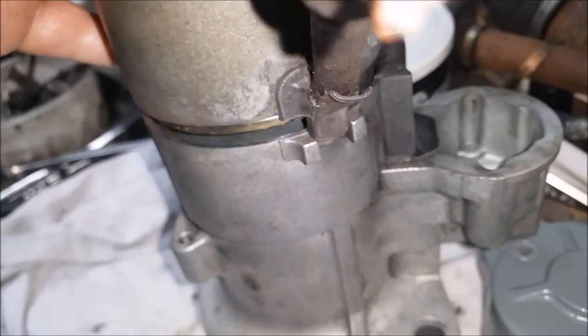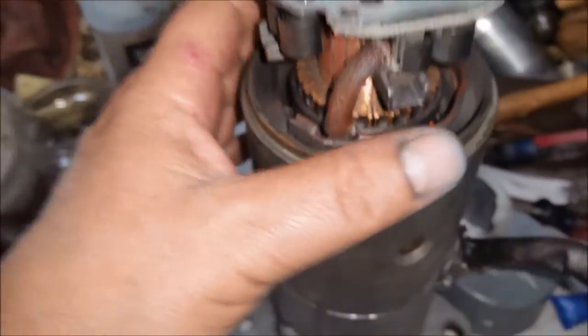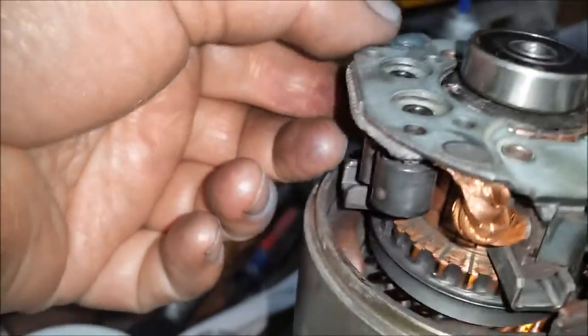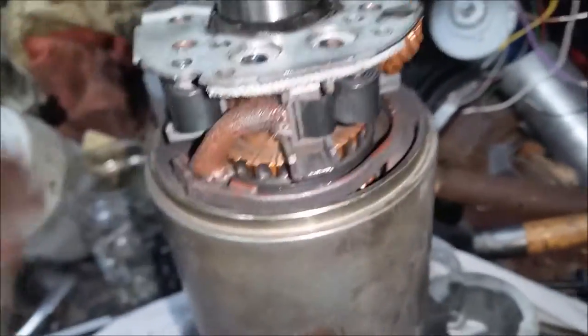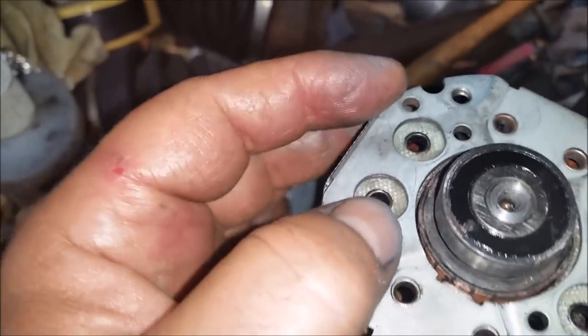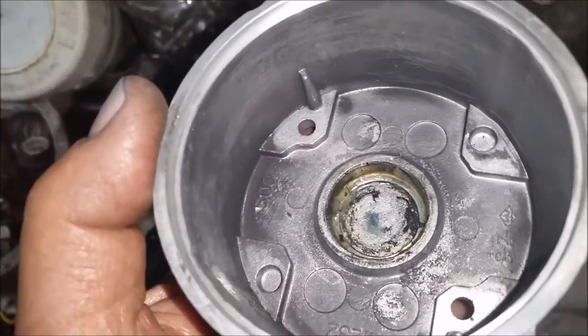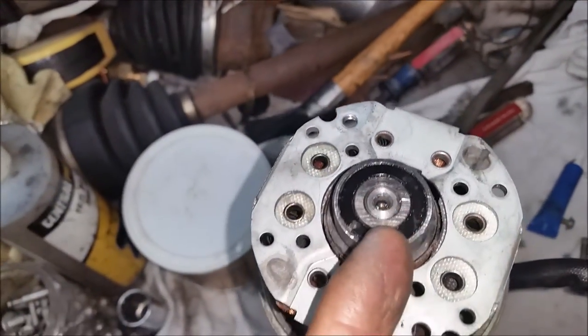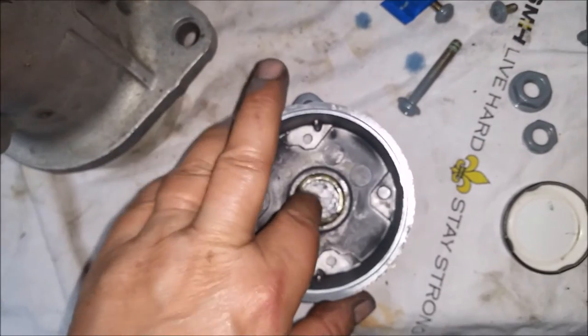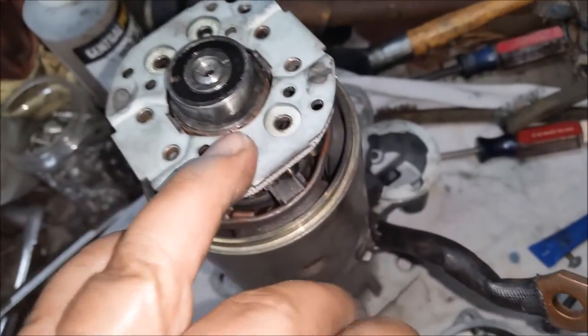Now you have to make sure that you twist this, pick it up maybe slightly and just drop it in there — then it'll set in. Now you can go ahead and push this down the rest of the way. Make sure that all your clips and everything are sitting up high all the way around, and make sure everything looks clean and not rubbing. All my brushes are sitting in there nice. Then you can go ahead and put your cap on. This cap needs to have a little bit of grease in the bottom. The grease is for heat transfer on this to the shield — it doesn't have to be a lot, but it's got to be enough to make contact with that bearing.